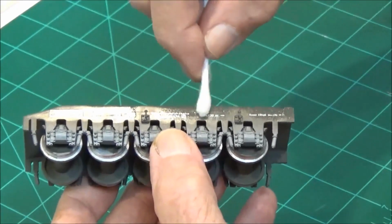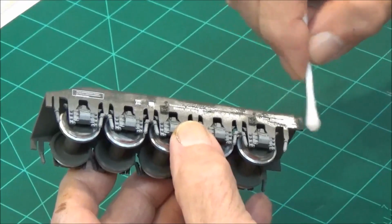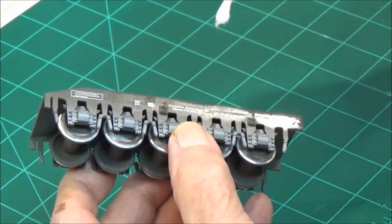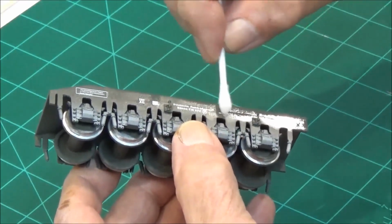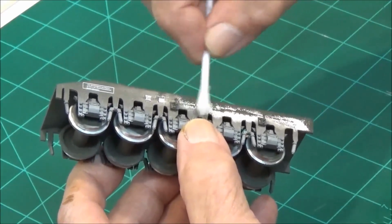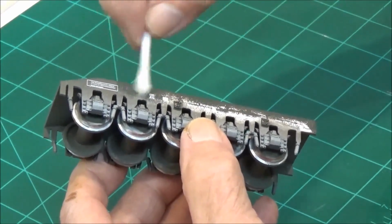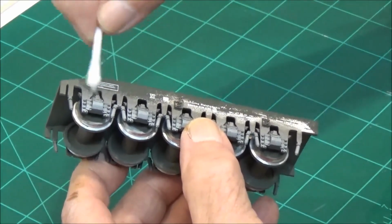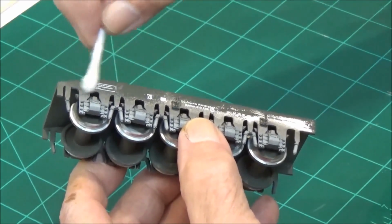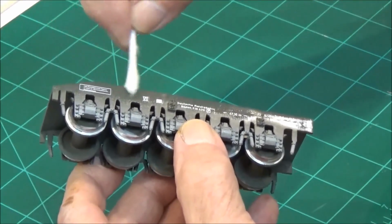Now I'm going to do it again because I can still see a few, but now it's really taking them off. You can see, from looking at the lens there, that it's going on pretty wet. But that's what you want. You got to get it to get down and break that paint loose. Take it off of there. I didn't want to use lacquer thinner because that's too volatile. But this Terpenoid, it's not bad.